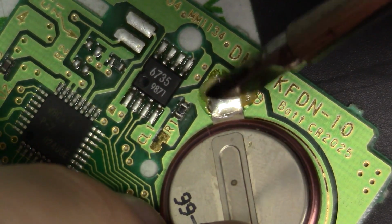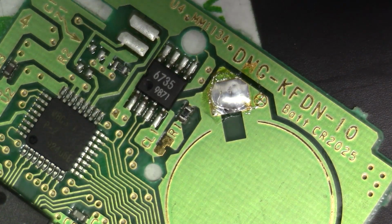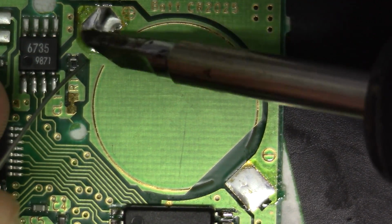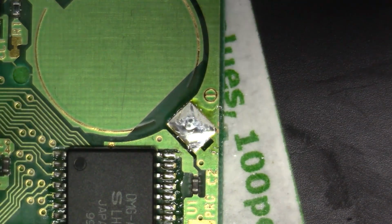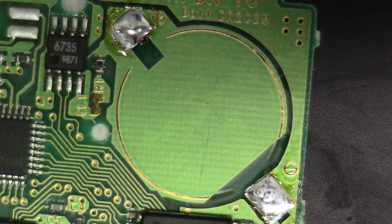We're going to float the tip above the solder here, and it just comes off just like that. And we're left with two beautiful landings here. And what we can do, if you really want to, I don't think it's totally necessary, we can just sort of introduce some fresh tin in there and some fresh solder. We're going to mix the chemistries up a bit. This is perfectly fine. It's perfectly healthy. So we have some nice fresh solder. It lowers the melting temperature based on what I'm using, and it just knocks that oxidation off just a little bit more.